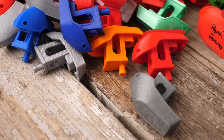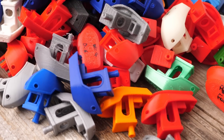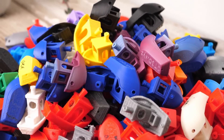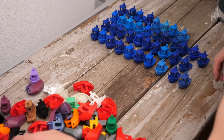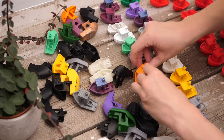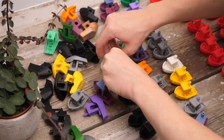Let's start with our raw material. If we just grind up all of the parts and melt them down, our final material would have a color that is a mixture of everything and would probably not look too nice. For this reason, I first sorted the parts by color. I separated red and blue ones from the rest because those colors were available in a significant amount. The leftovers that would not make sense to recycle separately will be ground up together as a mix.